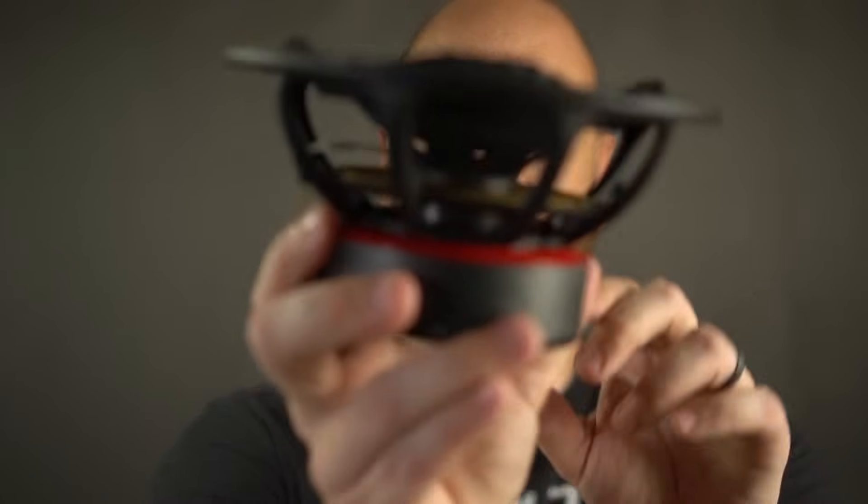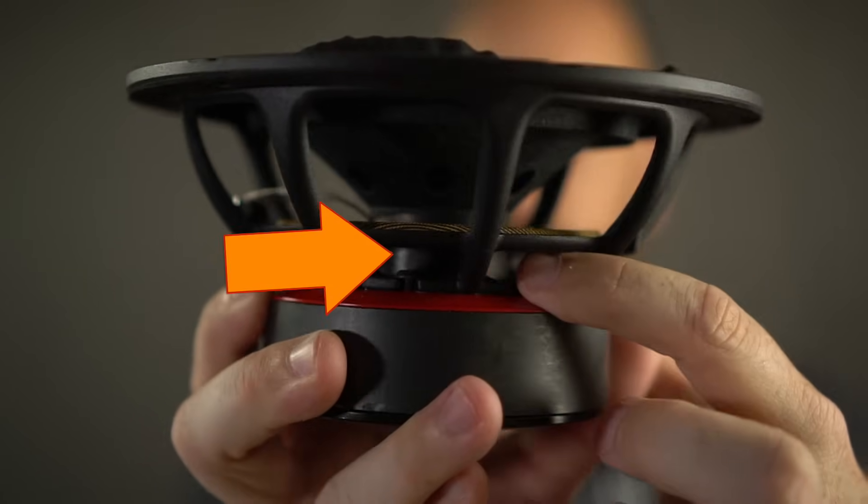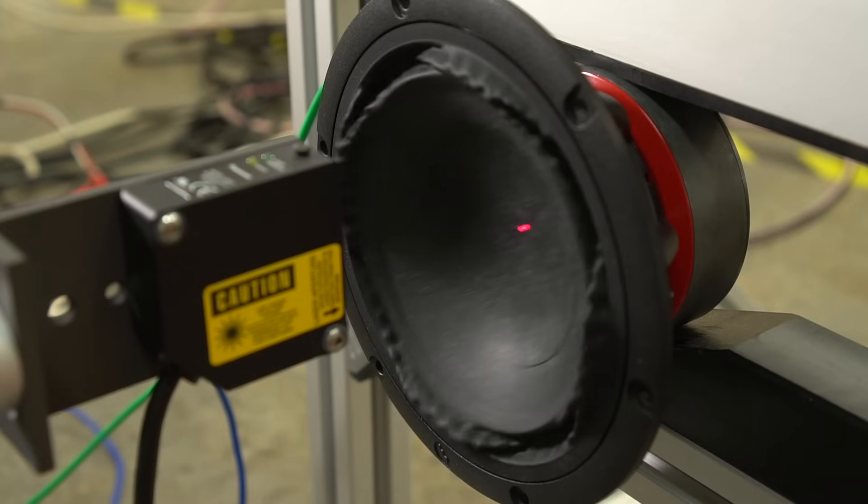The first one we're going to talk about is the PTT 6.5M. The 'M' stands for mid-range — you can naturally guess that this drive unit is better suited for mid-range capabilities as opposed to mid-bass or mid-woofer capabilities. The voice coil windings are a little bit shorter, so it's going to have a little bit less linear throw than the counterparts. This one has a linear excursion of about 3.3 millimeters one-way, verified by Klippel, and that is limited by BL — unlike the other two drivers which are limited by CMS, meaning the suspension is the limiter for those, whereas motor force symmetry is the limiter for this one.